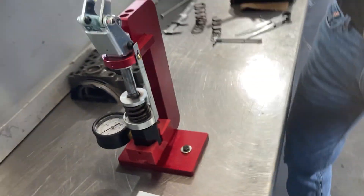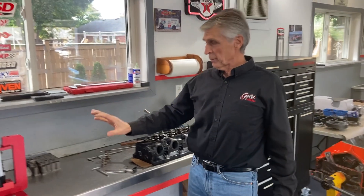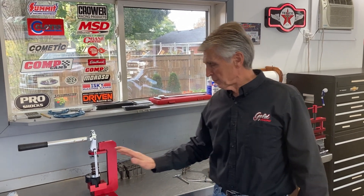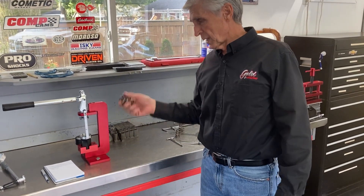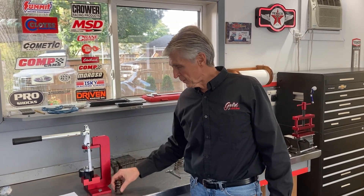I'm doing this quickly for demonstration purposes. If I'm doing this for final assembly, I may check it a number of times, make sure I get repeatability and accuracy, and be satisfied with the numbers. Any documentation would reference the actual numbers I achieved versus the manufacturer specifications, so we know if there's any variation. If you're wondering about springs that have been used and whether they've lost their force, and if you know their original manufacturer specification, you can actually measure them on your spring tester and determine whether they're losing any force or not.